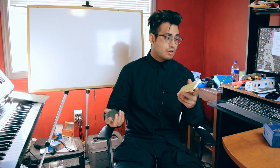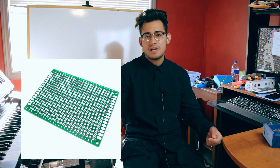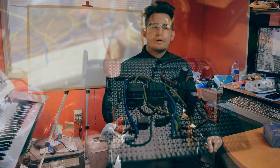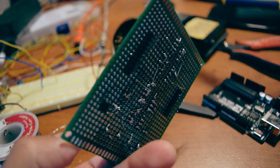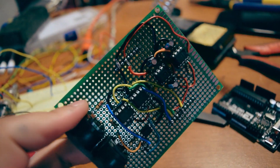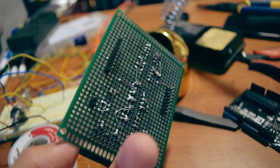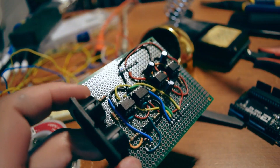If you did watch that video, you'll remember that where we left off the design was still on breadboard. What we need to do to get it into an enclosure first is make it rigid enough to withstand it, so the next step is to turn it into protoboard instead. Protoboard is basically just regular breadboard but with plated through holes — you solder on jumper wires or use component leads to make the connections. When I'm doing a really simple project like this, I take each component off my breadboard and put it onto the protoboard one at a time, making sure I get the exact same connections from my working breadboard.